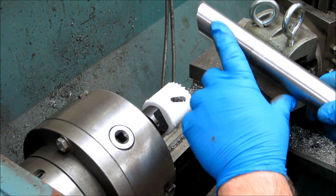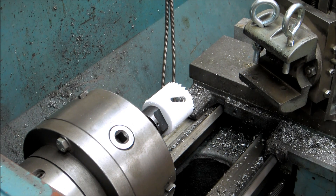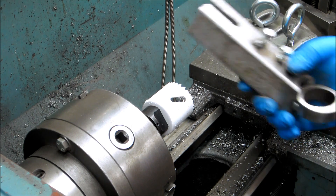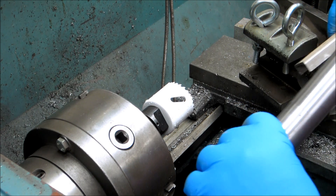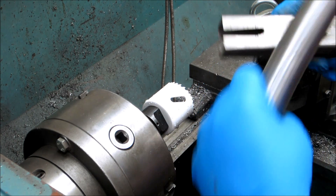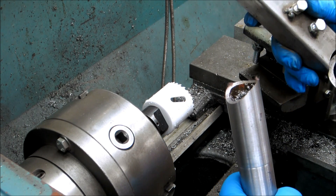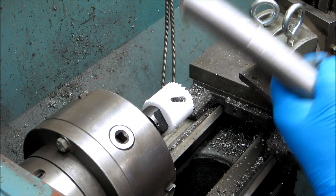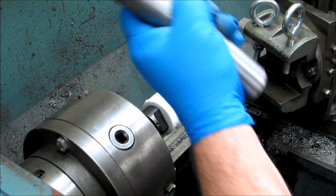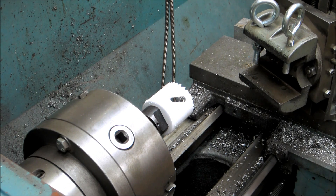The other thing is I left marks in here — this is just a test piece of tubing. I have this adapter made, and this was made for the other tubes. Basically, once the piece is fish-mouthed it goes in there and it locks. That way I could slot the tubing on another pass. I'm going to have to make something similar that'll handle this diameter. This is just a hair too big, and now that I have this on I'm not going to put it back in the lathe and turn the diameter down to fit. That ain't going to happen.